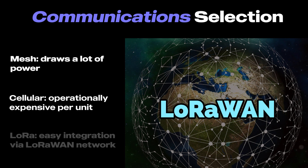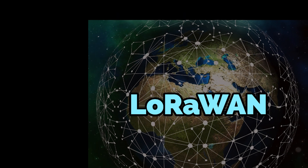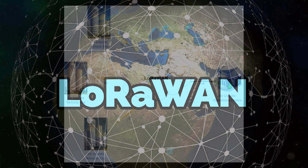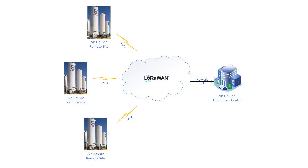To make integrations easy in the future, using the LoRaWAN network really makes sense. The LoRaWAN network uses a standardized communications protocol so that any deployed available network in the area can direct sensor messages to the right spot in the cloud. The architecture we came up with is IoT-based, where many gas monitoring sensors will be in one location connected to a centralized gateway that pushes information into the cloud and can be accessed through the internet.